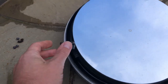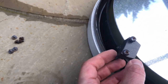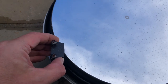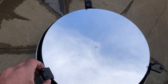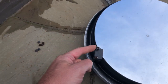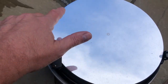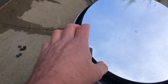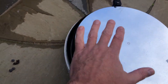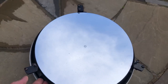I've removed these clamps, and you'll see they are metal on the top and rubber at the bottom — it's the rubber that grips the surface of the mirror. Just to emphasize, they do not grip it very tightly at all; they just lightly touch the mirror to keep it in place. We do not want to really tighten these screws because otherwise they'll introduce something called pinch error into the shape of the mirror. The mirror is ground and polished to an extremely accurate curve and then aluminized on top, so we don't want to introduce any distortion.